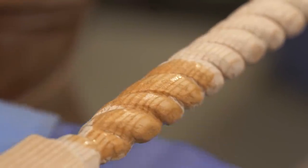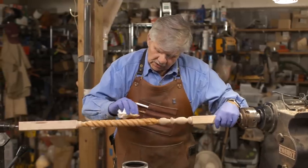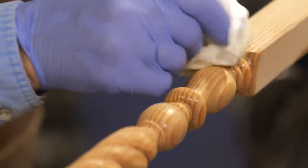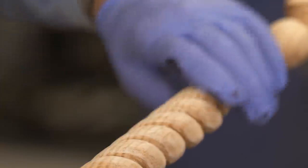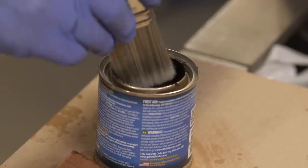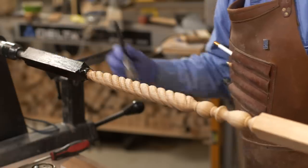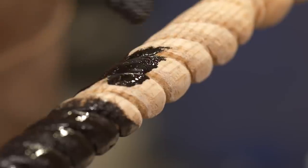Shellac is a good sealer, but make sure there's no wax in it — if there is, when you put the stain on, it won't stick well. Our shellac is dry. I sanded it lightly with some 220-grit paper, and now we're ready to put our first coat of stain on. This is a gel stain — I'm going to put it on, let it sit for a few seconds, and wipe it off. The shellac is also stopping the stain from penetrating deep into the wood, so it's not going to dry as fast.